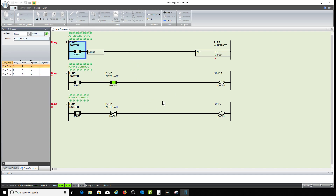You see how that works — it's pretty simple. The alternate bit takes whatever input you put to it and alternates the destination bit between one and zero. But you have to remember to put a SOTU or SOTD behind it. If you don't put that in there, you'll pull your hair out until you figure out you missed that one simple step. We're up to about 12 minutes now, so let's save this program.